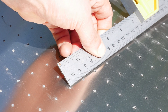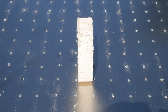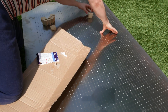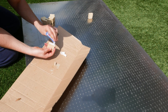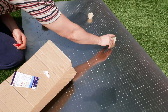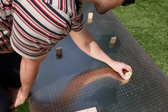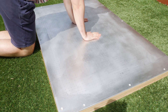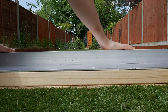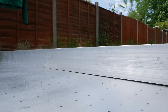Because this was a large sheet of metal, it would bow when I put pressure on it to screen print. So I had to cut some spacers to use as support. The gap between my holes was 20mm, so I cut 17mm wedges of wood from the same wood used for the frame — keeping them smaller than 20mm so they wouldn't block any holes. The spacers kept it nice and sturdy, but I did notice a slight convex in the metal sheet when I put a straight bar on it. I tried to bend it the other way but didn't have much luck.